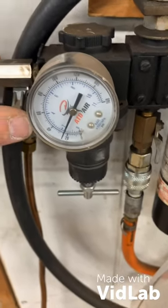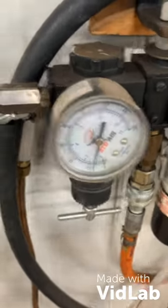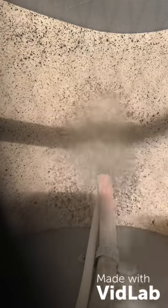When it's standing still it's turned off, so we'll turn this on — there's this valve — and we're at about 18 PSI now. What this does is it comes over here and tees into our feed line. It's sticking out about a half inch past the end of the red feed line, and all it's doing is blowing that 18 PSI to agitate the media in the bottom of the bin.